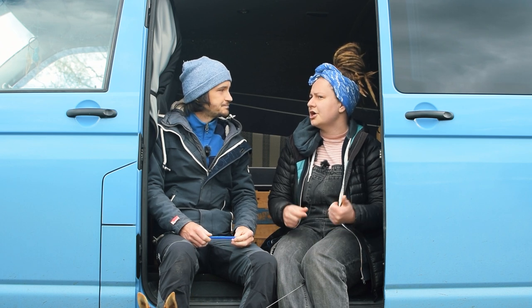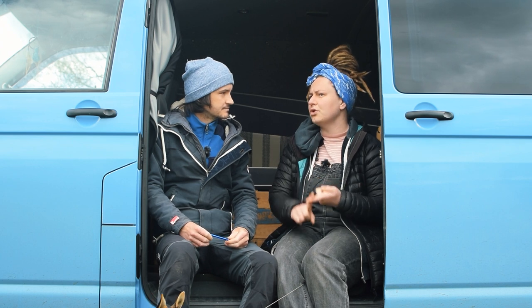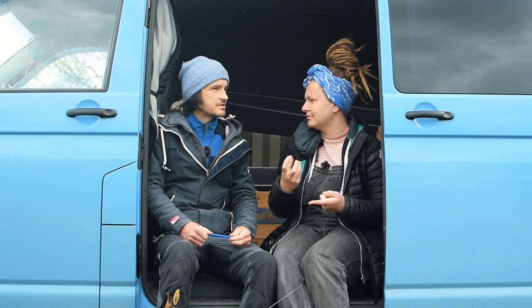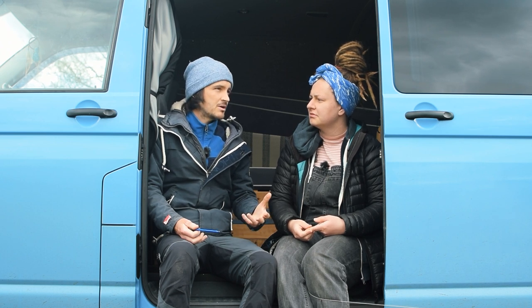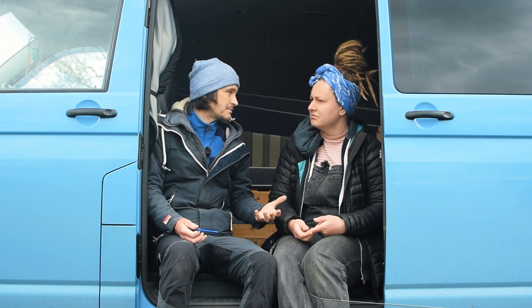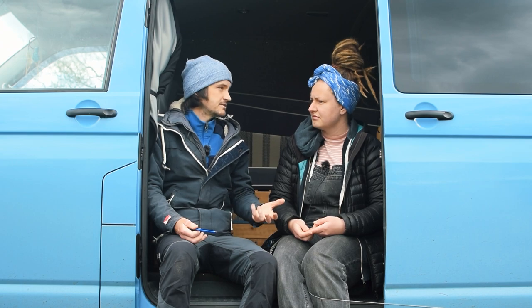So a couple of questions for you. What I've been thinking privately over there is what's the maximum thing you can draw off of it? Well, the inverter goes up to 200 watts continuous with a 400 watt peak. Take, for example, our editing laptop, a very capable, very high-end machine. That only draws 130 watts. So that puts it into perspective for you.